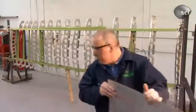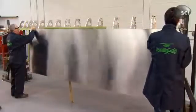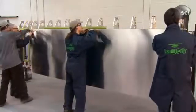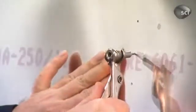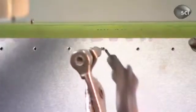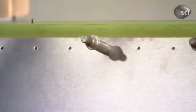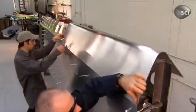The completed airframe now goes on a positioning rack to receive an aluminum covering they call the wing skin. Workers use spring clamps to position the aluminum top skin onto the airframe. They use the same procedure for the leading edge wing nose.